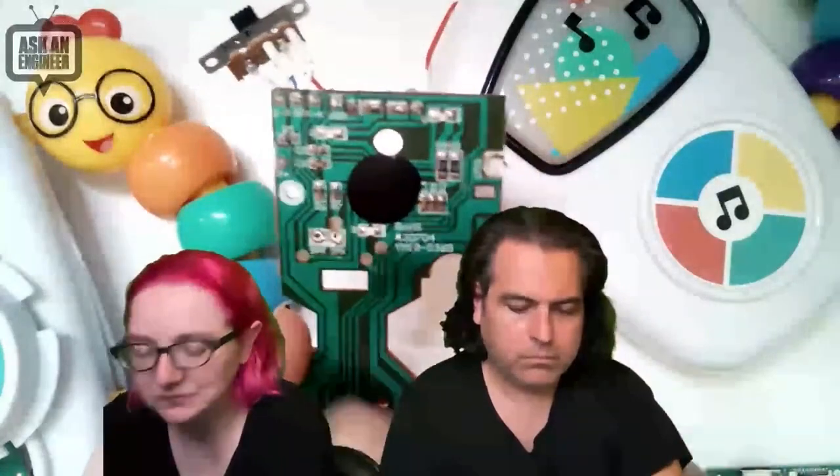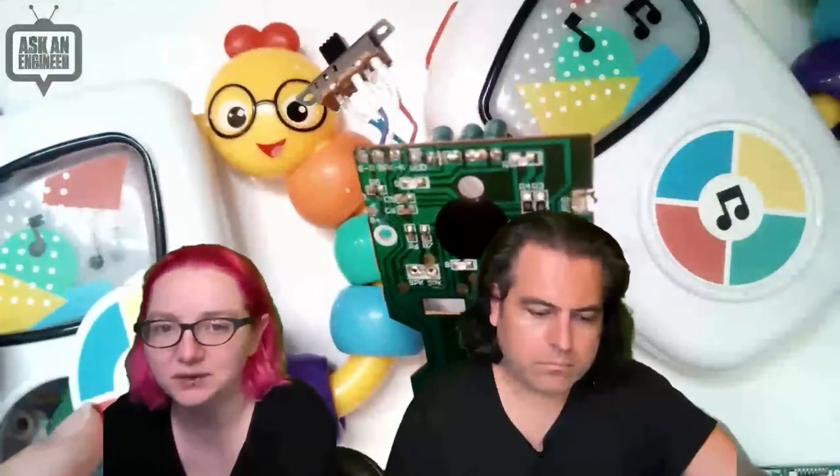In previous My Little Hackers episodes, we took this apart and found the board inside. Not surprisingly, there's an epoxy blob, and there are about three LEDs - one red, one green, one blue. I'm actually kind of surprised these are true LEDs and not just wire-bonded on. There are only a couple of components, plus a switch we have to recycle, a switch-cap converter, and an elastomer button. We scanned and retraced it, then tried using an ESP32-S2 - soldered one in, got it playing with the speaker, and verified it can run off the battery.